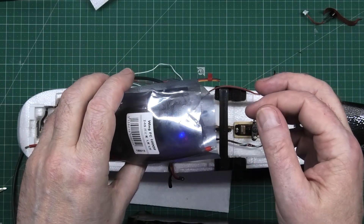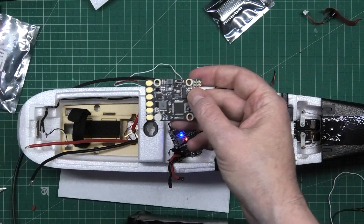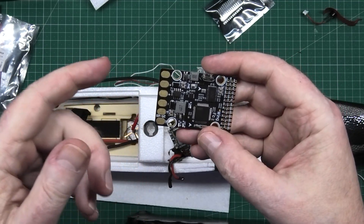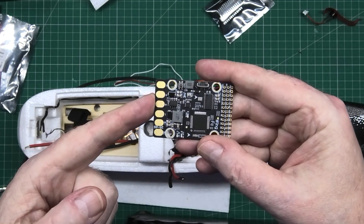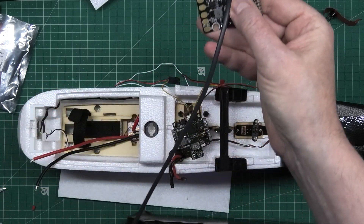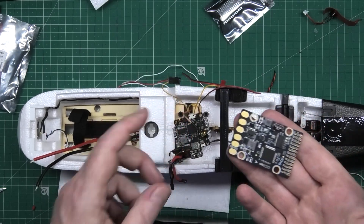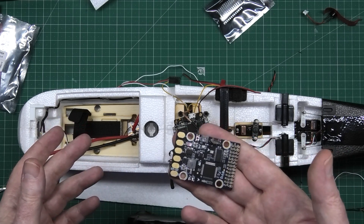This was sent to me for review as a pre-release thing, about 18 months ago. This other one is designed for a wing — it's got a current sensor, OSD, everything that the other one has got apart from the VTX. So I'm going to fit this one, but I've got to try it first and make sure it works. Programming connections on the top makes it a lot easier. It's an F4, same processor, same everything — I'm going to use that instead. I'll need a separate VTX.